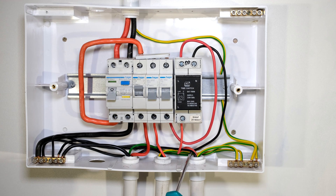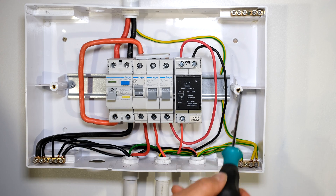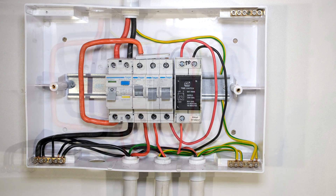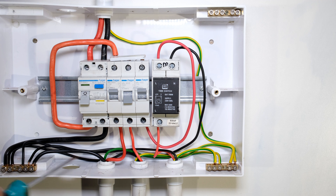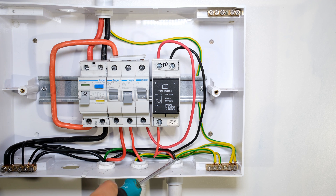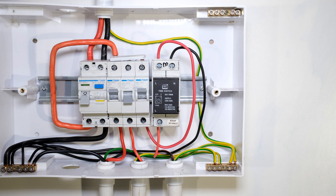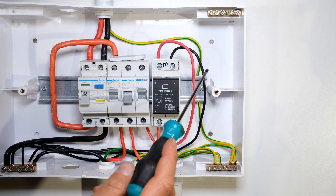The output of the timer is now connected to my light circuit. If I was not using this timer switch, I would have connected the lighting circuit directly to the output of the circuit breaker. Because I'm putting a timer switch before the light, I go from the circuit breaker into the timer switch, and the output of the timer switch goes into my lighting circuit. Note the neutral for that light circuit is still connected at the neutral rail — I did not change it. I used an additional neutral wire for my timer, because the timer needs a little bit of energy from the live and the neutral to work.